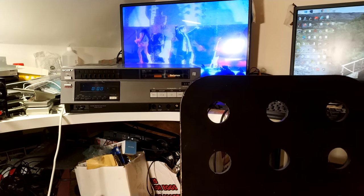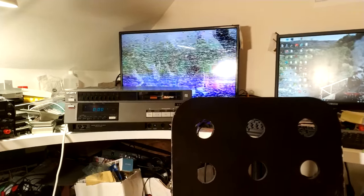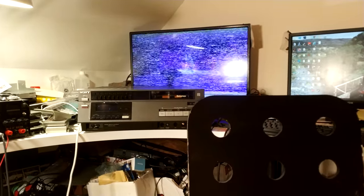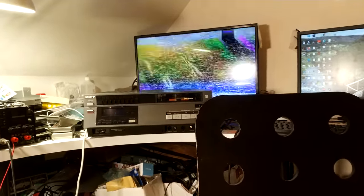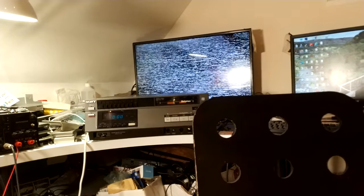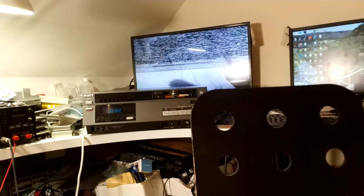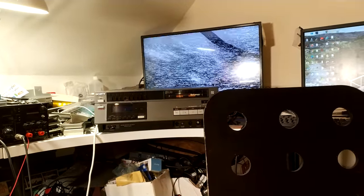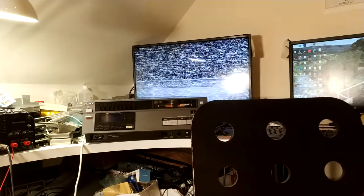Now, the other thing that's odd about this is I was sort of watching it after I'd recorded part one, and occasionally I get a perfect picture in play. It will suddenly just appear perfectly clear, just for a split second, and then go back to this, which does make me think that I've got some sort of problem with those coils, or with the wires up from them. It's all part of the coil anyway, but wires up to them from them to the solder pads. So let's investigate.